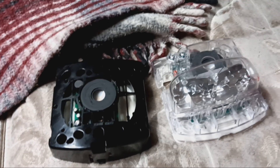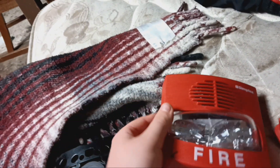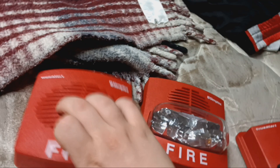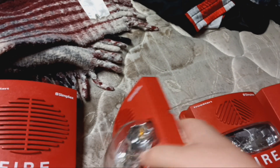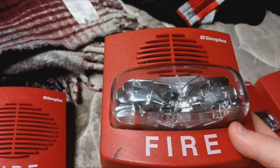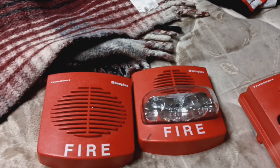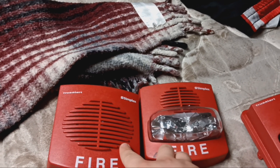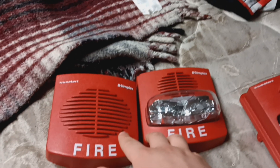These devices are the most user-friendly. Since this is the 4901 series, it is a remote horn — audible only. Since this is part of the 4903 series, it's going to have a candela sticker indicating fixed candela — in this case it's 75, as you see right here. If I were to give these a score, I would give them 100 out of 100. I don't see any handicaps with these devices, and these are the ones I recommend the most, including the 49CMTV series of True Alert multi-tone lines, since those are completely conventional and user-friendly.